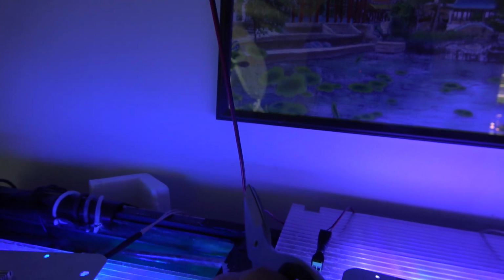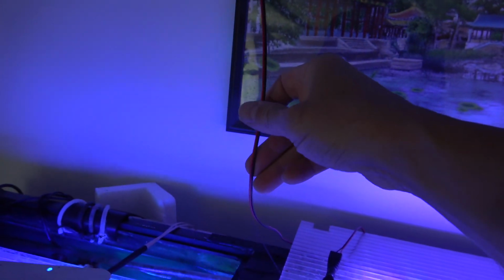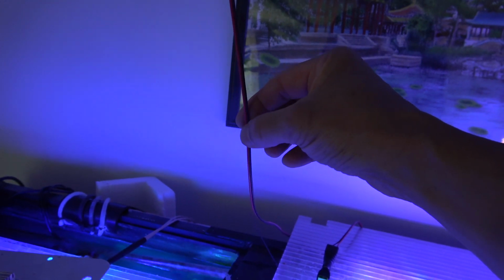through here. It may or may not arc. I'm not gonna take the chance because we're talking about 48 volts, well, 70 volts really. The amps aren't very high on that, but I don't wanna ruin this wire somewhere because this wire is pretty thin. I'm pushing it with how thin this wire is. I should probably have a thicker wire on there, but it's possible that it could melt it even within the split second that it touches.